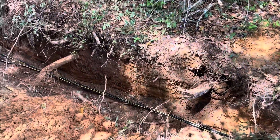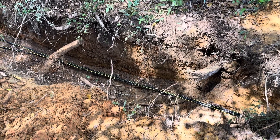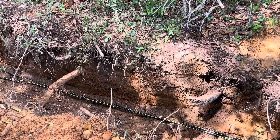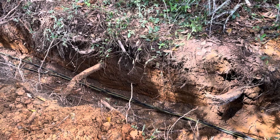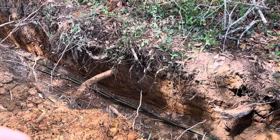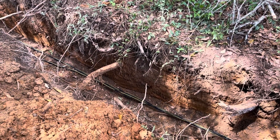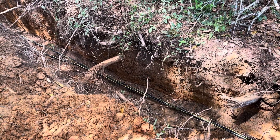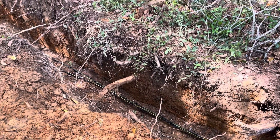We have three source wires and then three spares for a possible future set of panels. It's number four direct burial aluminum. I chose to put it directly in the ground versus conduit because the cost of installing the conduit was almost the same as the cost of the wire itself, so I'm no better off if I have to change them out or add another cable.